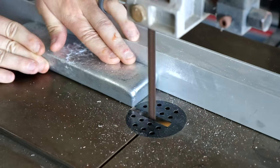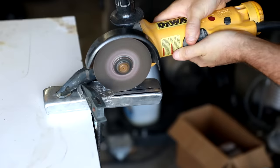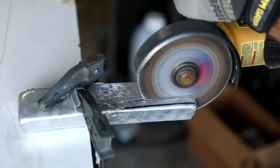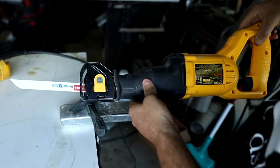First, I attempted to cut it on the bandsaw, which it did not. So next, I tried my luck with the angle grinder and a cutoff disc. Ground away for quite a long time until I thought maybe it was thirsty. Then I decided to try the reciprocating saw, which only clogged up the teeth with metal. Went back to the grinder to clean up the edges. Then brought it to the shed to finish cutting off the piece. Once torn a twain, smoothed on the belt sander until I had a perfect little blank to work with. Incoming belch. Okay, wow, this was a huge pain in my butt. Apparently zinc pewter does not like being cut.